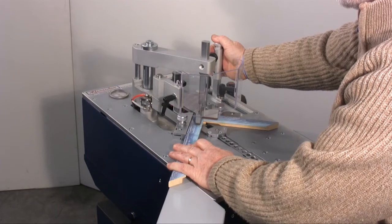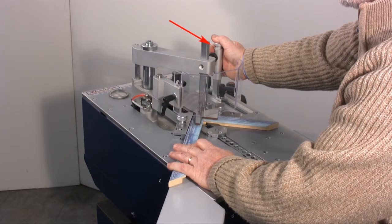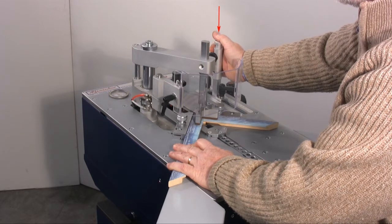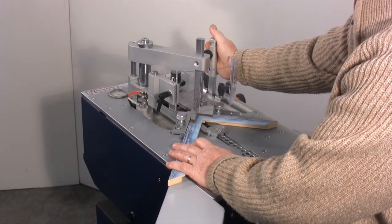Then with the right hand you press the button which is on top of the so called joystick. The button has double commands. By pressing it half way it makes the vertical presser lower. By pressing it completely it makes the wedge come out which going upwards penetrates the frame.